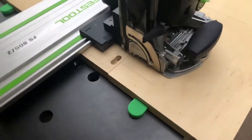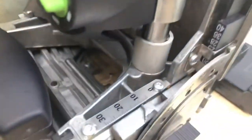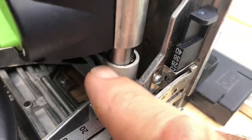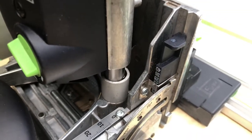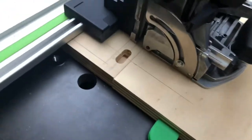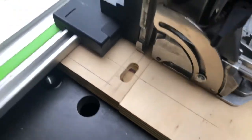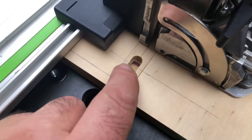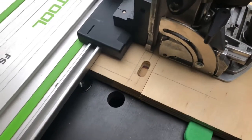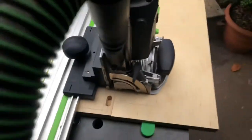The cheating is I've got some shallow domino holes, and I've created them by — see in there — I've got a little sheath and that's a little stopper, and that stops the cutter from going in too deep. So I've got the cutter going in about four or five millimetres. What I'll do is drill a hole in the middle and that'll be a screw hole, and then I'll just cap it off with the domino and sand it off. Like I say, I'm trying to get this done quickly, but anyway, beside the point.